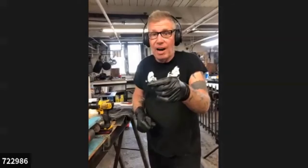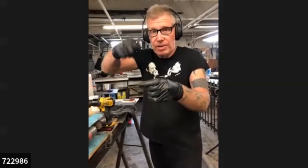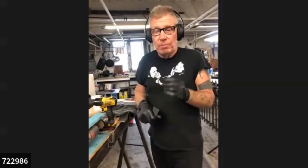Right. It's a good question, and I may not have emphasized it enough that the smoother the surface, mirror finish being as smooth as it gets, the less resistance as you're moving it along. When you do the repoussé work, you'll find that you're using it almost like an iron, and you're tapping down, and you're not going to leave the impression of whatever minuscule little scratch you have in it, nor are you going to catch. The copper is soft and the steel is hard.